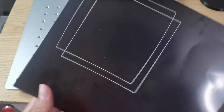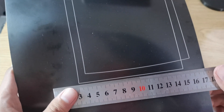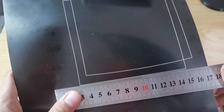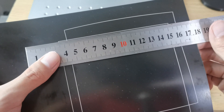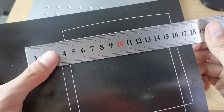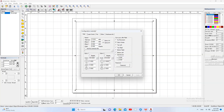The lines are straighter. Now we check the lines with the ruler. They are still a little convex, so we need to increase the galvo-2 parameter. We should adjust the parameter, then check the marking result, and repeat the process again and again until we find the best parameter.